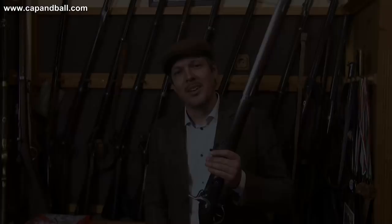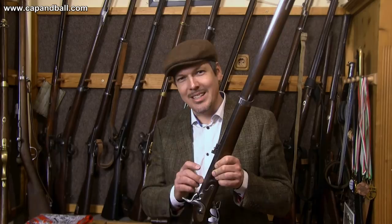When Pedersoli started to work on the silver line muzzleloading military rifles — with the Springfield rifle, the Enfield rifle, and also the 1857 Mauser rifle as part of this line — they set a new standard for accuracy and quality of reproduction. So now we are not just talking about whether it looks like the original rifle, but whether it exactly replicates the capabilities of the original. Let me tell you one secret about this bore: it's a cold forged bore with the same rifling pitch and same groove and land numbers as the original — 2000 mm in one turn, which is 1-in-78 inches twist rate, the same as the Enfield twist rate, with four equal lands and grooves. So it is technically the same barrel.